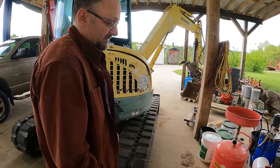So I think that basically I have wear in the drivetrain. There's probably some in the travel motor, but more so in the control valve and in the pumps. What that equates to is, as it was hooked up when I got it, it goes to the left. But when I flip the pumps, it actually goes to the right. So the pump seems to be a major factor. But now the pumps are tied together and it's going left. Basically, the pumps have been eliminated. They're acting as one pump now, and I'm going to the left. So it's got to be the left control valve or the left travel motor. My testing concluded that the pump was the primary issue, but now I've eliminated that, I still have issues. Of course I have issues.